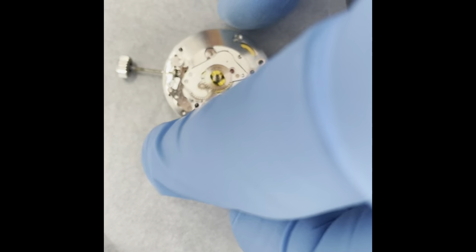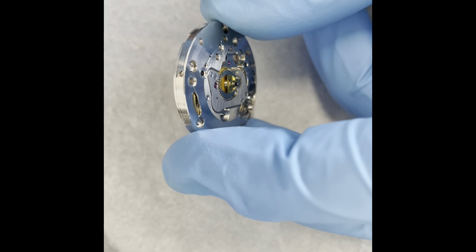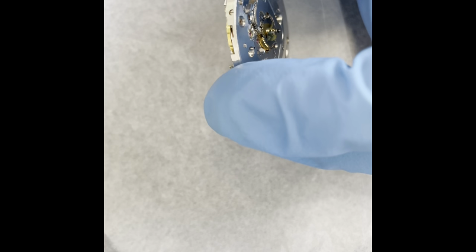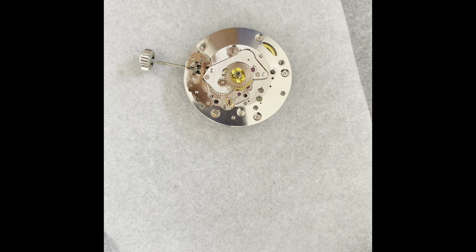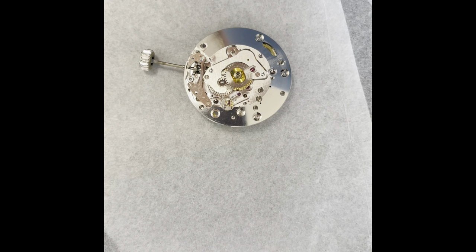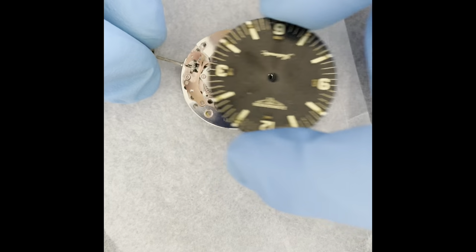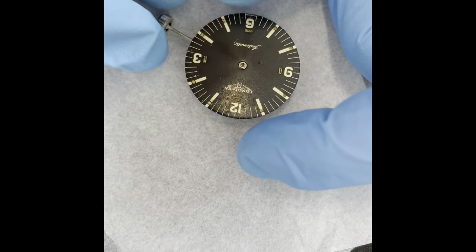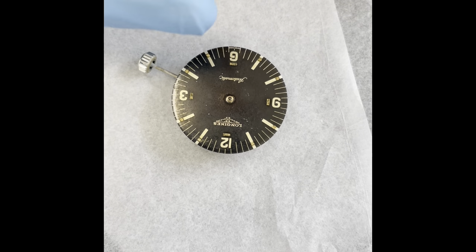So put that on. I'm going to loosen the dial screws. And then I'm going to hold my breath as I fit the hands onto this dial. First, I go to fit the dial onto the movement. This, of course, comes on an angle, so the winder isn't at 3 o'clock because it's a super compressor case.